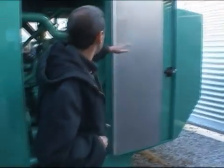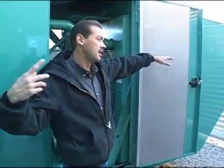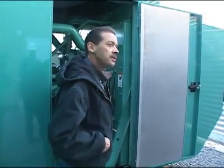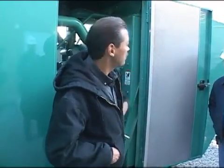You do have a set of motorized louvers on the front at the outlet — same as the intake. So when you run it you're going to want to make sure you can see through here and see them open. You kind of hear it because your airflow won't come out the front.